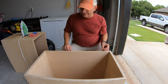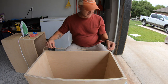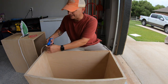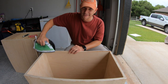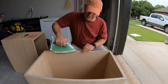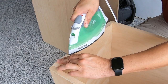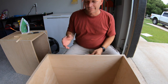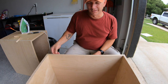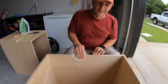Something that I didn't do on the desk last time is cover up the exposed plies on the front of the cabinet with some iron-on edge banding. We just cut this to size — all you have to do is measure it out, cut it to size, and then just iron it on with an iron. There's a heat-activated glue on the bottom that makes it adhere when you iron it onto the board. Typically the edge banding comes a little bit wider than the plywood, but you can just take a piece of sandpaper and sand it flush.